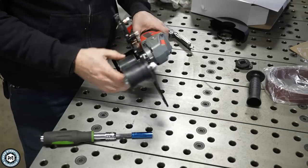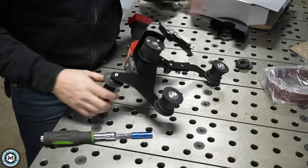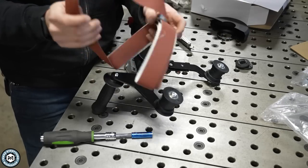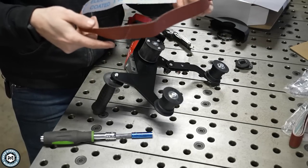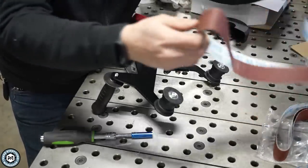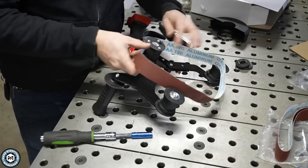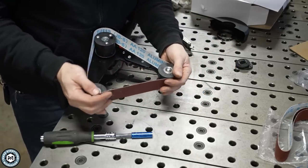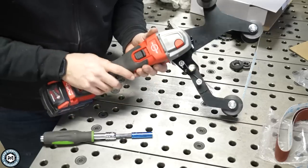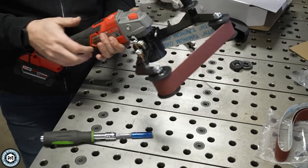It's out of the way, it'll still rotate, and we have our alignment. The rest of the setup is literally just putting on the handle and then loading some belts — it comes with belts. The belt size on this is one and a half by 30, but you can also get away with one by 30 belts. You put the belt on simply by compressing the arms, make sure it's on the drive hub, get a battery, and this thing is ready to go. We'll set it down to speed one — the slowest setting — which on this grinder is 3,500 RPM.